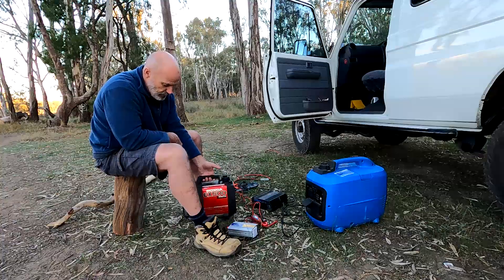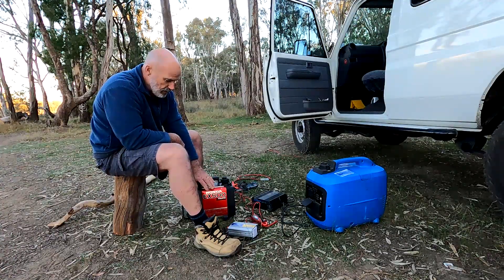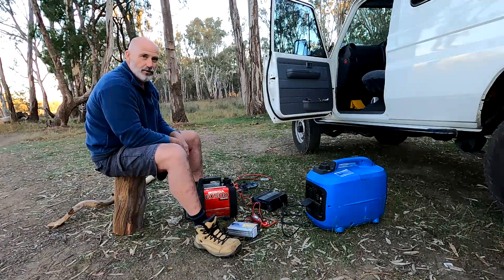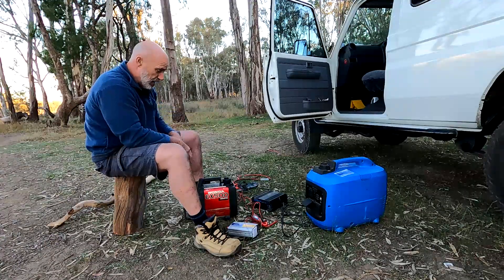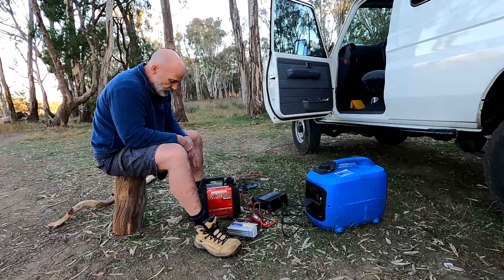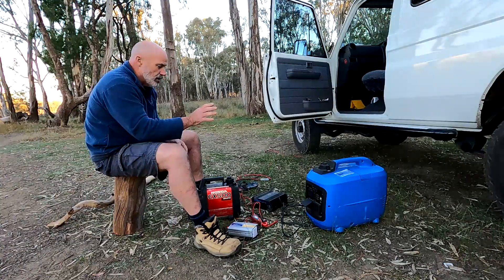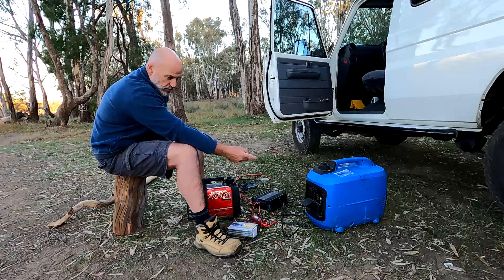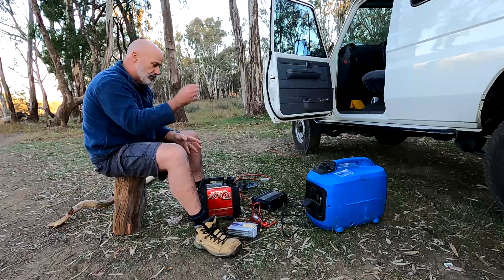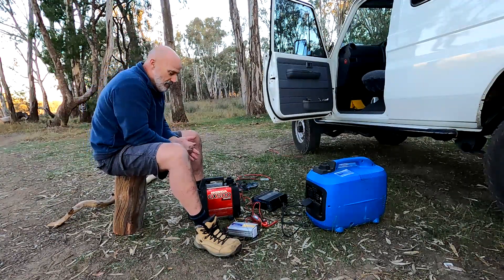Even this little EX500 — 500 watts peak, 450 watts constant load — runs at just under 2 amps, about 1.9 amps, so it's almost capable of running that 20-amp charger as well. You're not going to get the full 20 amps to the battery, but this thing weighs almost nothing, uses very little fuel, it's two-stroke, very quiet, and a pure sine wave inverter — which is gold. Bottom line: be careful if you're going to use generators with the 12-volt plug directly connected, because none of them are regulated. It's a straight power boom into your battery and you've got to monitor it so you don't overcharge, boil, and completely destroy them — because then there's no work on Monday and nobody wants that.